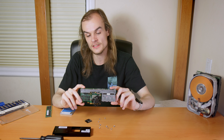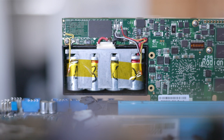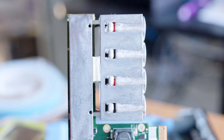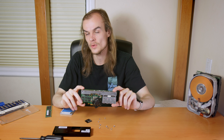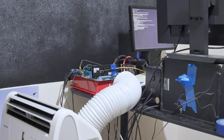Interestingly, this bank of capacitors is not connected to anything else thermally — there are plastic screws holding it in, and plastic covering everything when the normal casing is on. But there is a Peltier unit connecting it to the big heatsink on top, and it works like a mini heat pump, making one side cold and one side hot.